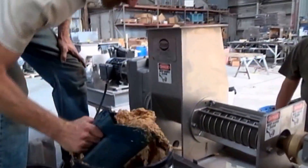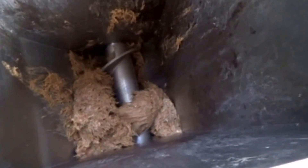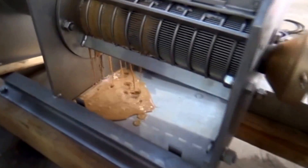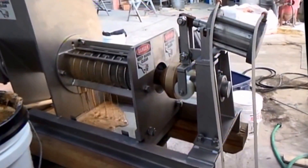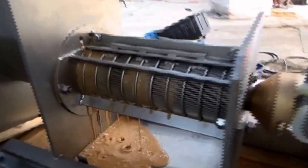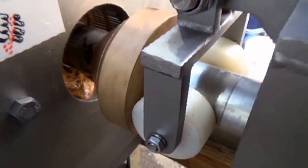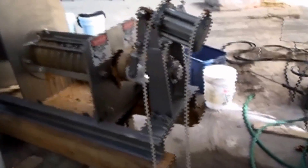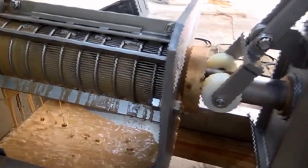That's the discharge cone right there — go ahead and start feeding some of this material in. Look at the water we're getting out! Without that press aid we wouldn't have done that. We're going to let that part fall on the floor and start a test. You can see it progressing towards the discharge. There's my discharge — you can see the screen. This screen has about 15,000 openings in those slots. There the cone went in, and we'll start building up a cake — getting a good dewatering action here. We'll see if it keeps up or blinds over.